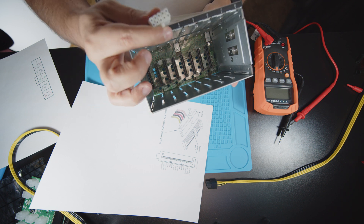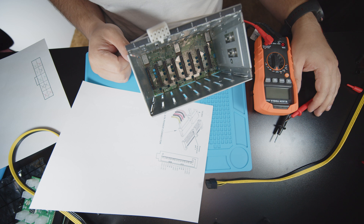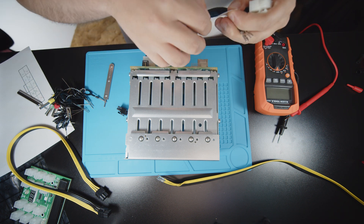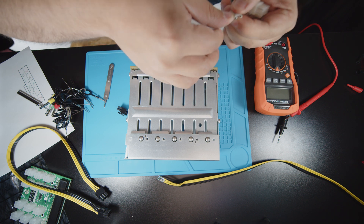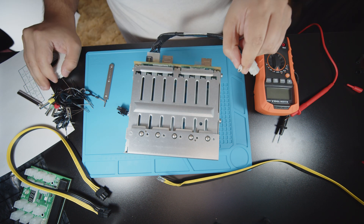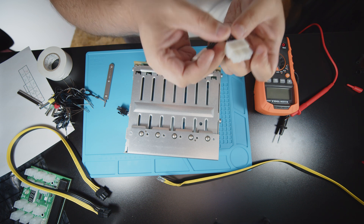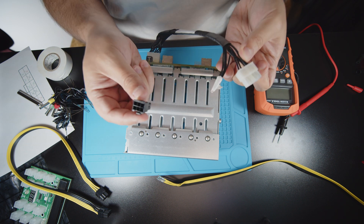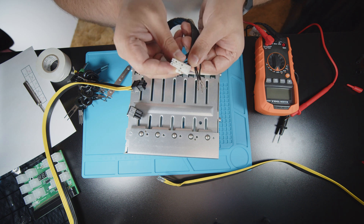Now I know which ones are interconnected, which ones are 12-volt, and which ones are ground. That means we can start poking these pins out — that's going to take a minute, so I'm going to pause and come back. Now I've pulled out all the ones that are not going to be connected to anything, and I just tape them together making sure all the metal is covered and get them out of the way. I prefer pulling out the three that are the same group and sticking them into the new connector as soon as I pull them out. I've pulled out everything except for the ground — you can verify that it's the ground by looking at the pinout you've drawn.